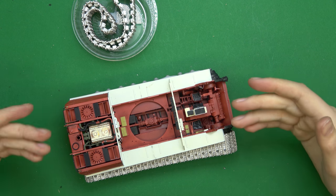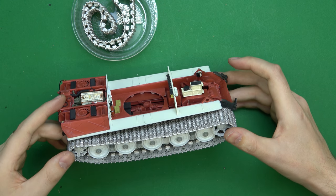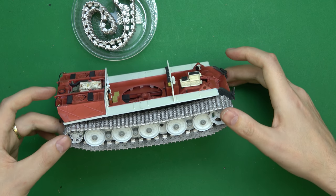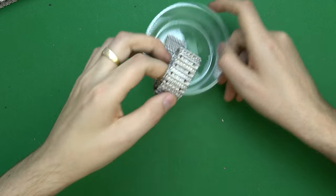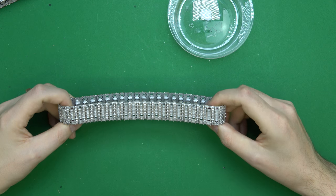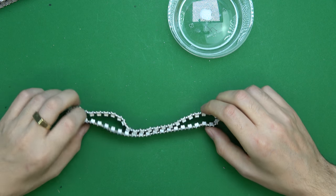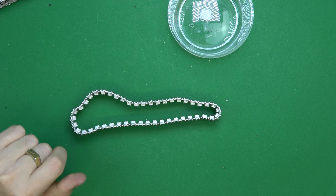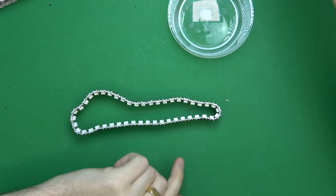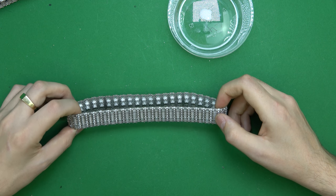After much time, and my fingers are now basically bleeding from the amount of pins I've had to shove through all these tracks, we've actually got there in the end. I have two sets of tracks — the ones on here, which I've got to about the right length, and these for the other side. I put them on, measured it, and the sag and everything looks good. So I'm going to tidy up some of the pins and then we're going to start looking at doing some burnishing, which I've never done before.